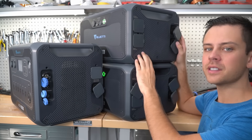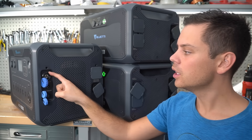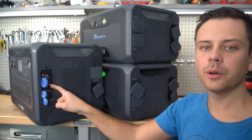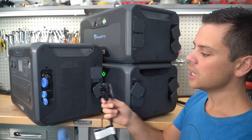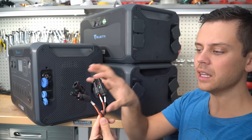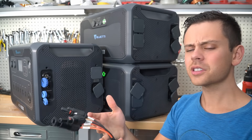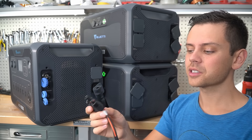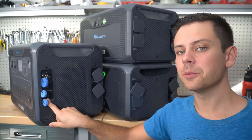Now let's put it together. On the side of the main unit and the batteries, this is where you connect everything. On top, we have the AC charge input — you can connect 30 amps with this cable. Right below that is the DC solar input, where you connect this cable and can attach two solar panel arrays with MC4 adapters. These are separate inputs, but you can parallel them if you change the settings on the screen. Below that is a communication interface, used if you're creating 240 volts with two main units.